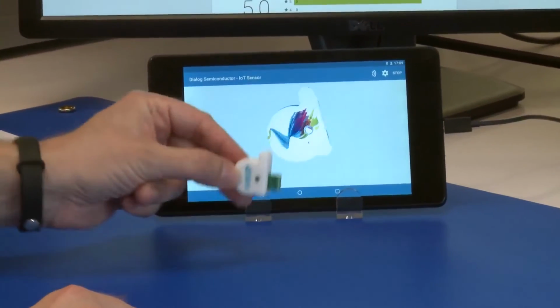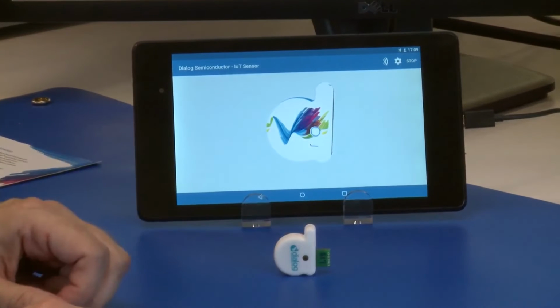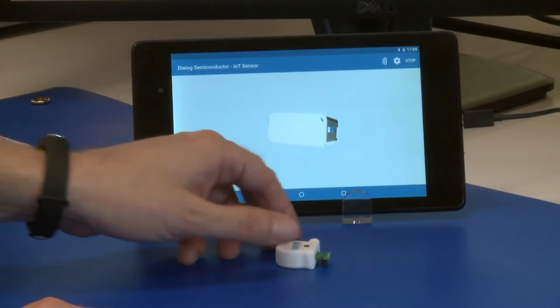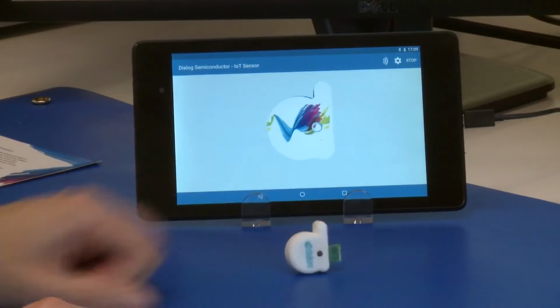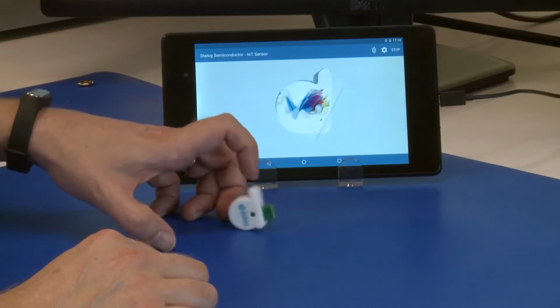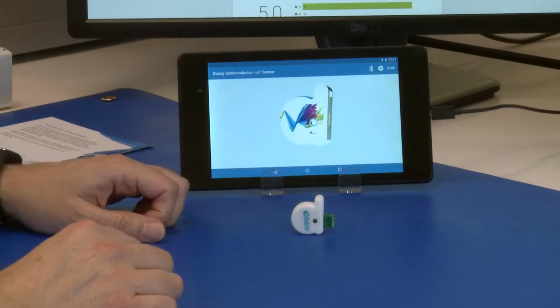The raw sensor data is actually fused by the Cortex M0 of the DA14583, and only the orientation of the sensor tag is transmitted via Bluetooth Smart. This limits the amount of resources required on the central side and also reduces the power consumption of the sensor tag itself.